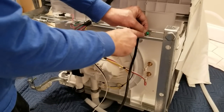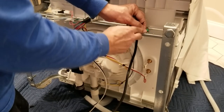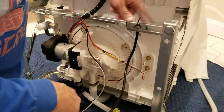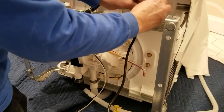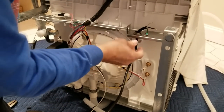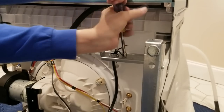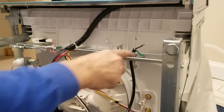When you're wrapping wire around a screw, you always want to wrap clockwise. The reason is, if it was going the other way and you tighten the screw, it'll keep unraveling the wire on you. Make sure it's nice and twisted, then get it on there. For these little green ground screws, it's always best to use the 5/16-inch nut driver — it's way easier than doing the Phillips head. So now we're grounded, and we're going to take our other two wires and run them in.